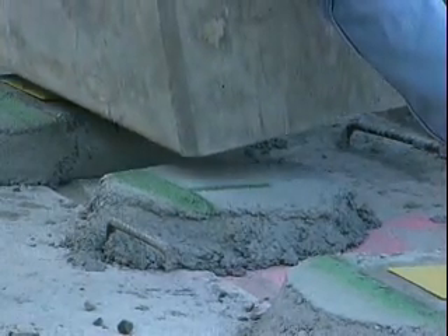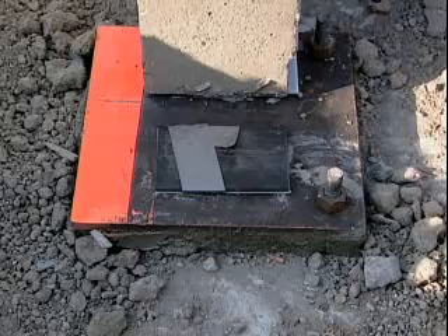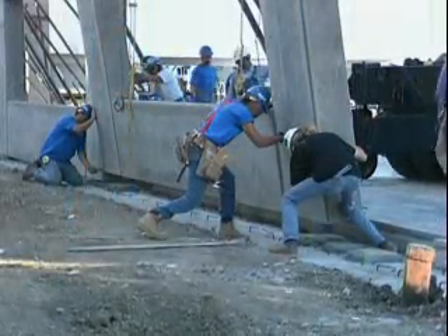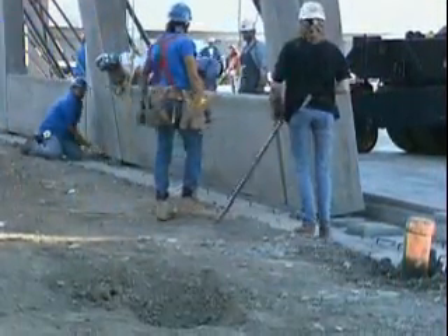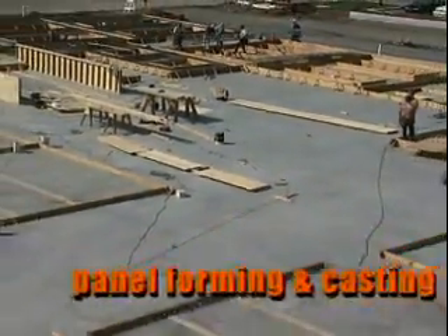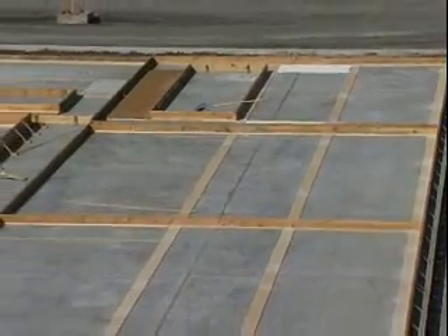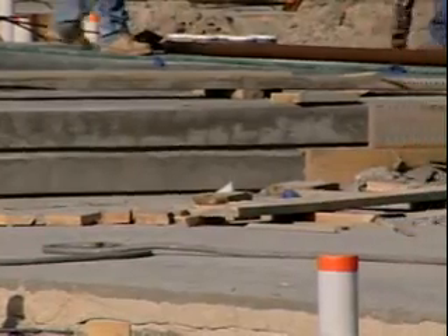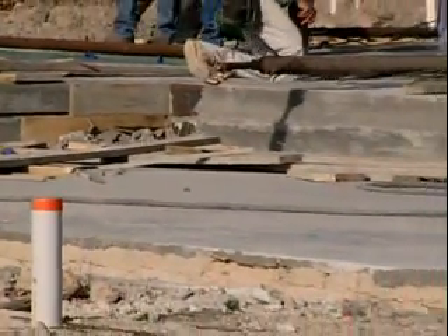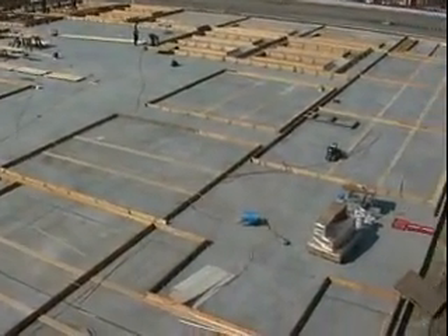Offsets in the top of the footing or a placement rod may be cast into the footing to aid in the placement of the panel. Pad footings are occasionally used since the size and depth of the tilt-up panel can be used as a beam to span between pads. Pilings or piers with a cap can be used in unstable soil conditions. Panels may be formed using a variety of methods — individually or in long walls with a common divider strip. An advantage of the common divider strip is that adjacent panel edges always match. If floor space is limited, panels may be cast on a casting slab or stack cast on top of one another. Proper planning ahead of time will ensure an efficient and successful construction process.